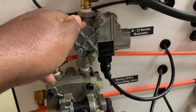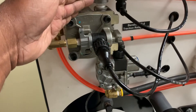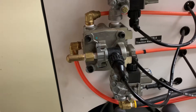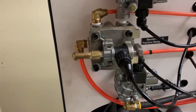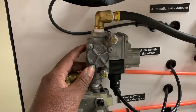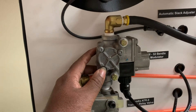Basically, we have a situation where traction control is acting in concert with my ABS system. From that we can derive that we can always have an ABS system and not have traction control, but we can never have a traction control system without the ABS system being intact. I will cover the modulator valves in a separate video — even though they're relatively simplistic in function, I'd like to cover some ways in which they can go bad.